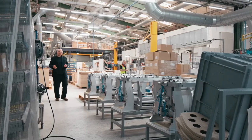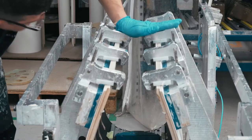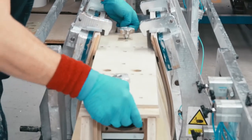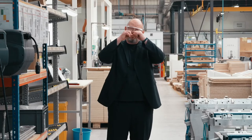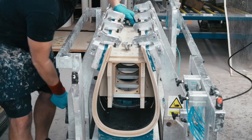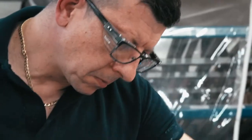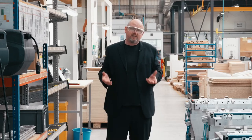After the loudspeaker has been taken out of the CNC cutter, the next stage is to bring it to a device we call the spreader. What the spreader does is allow us to open up the cabinet ever so slightly — just enough to slide in the internal components, and in particular the matrix assembly which we use to reinforce the cabinet in all directions. The spreader grabs the sides, slightly opens it up, we slide the completed matrix assembly in and glue it in place, then close the cabinet back up and let it sit under pressure for two hours. After that it sits for a further two hours to completely cure off, and at that point we have our completed loudspeaker cabinet.